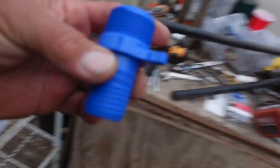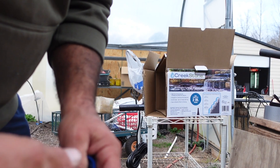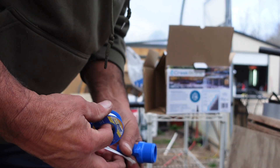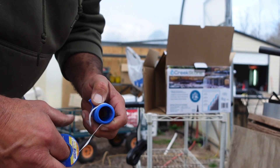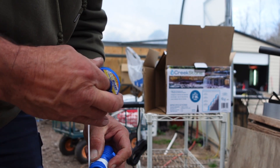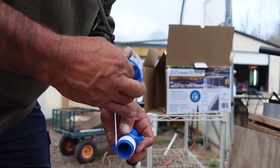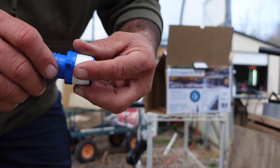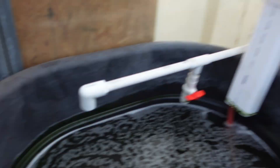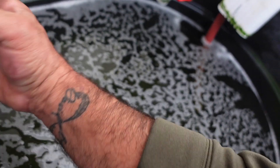We've got a one-inch outlet on the pump and the hose will go right on top of it. We've got to go up inside so I've got this hose barb here and we're going to screw it up in there. I've got to put some tape on it first so we don't have any leaks. You always want to tape in the direction you tighten the fitting — if you go against it your tape will be all jumbled up and it will leak. Whatever way you start the threads, that's the way you want to tape it so when you screw it in, it goes with the threads instead of taking the tape back off. Now I'm going to hand tighten it and then get pliers to finish it.